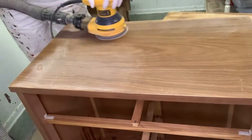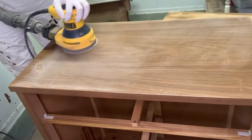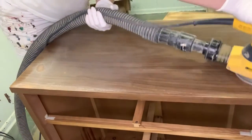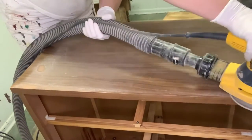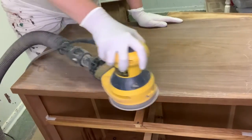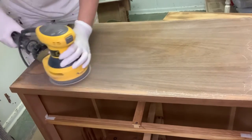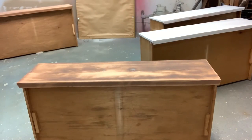Now, if this piece had been totally perfect — a totally glossy, perfect piece of furniture with no hardware holes to fill, no scratches, no bubbling, nothing — I could have actually forgone the scuff sanding and used a bonding primer such as Slick Stick from Dixie Belle. That bonds to plastic, glass, tile, and melamine or slick surfaces for furniture. However, because this piece did need some imperfections sanded out, I decided to sand and use BIN shellac-based primer.